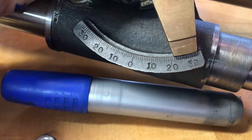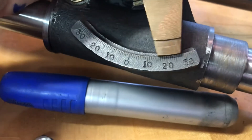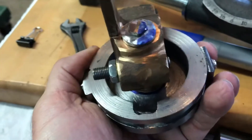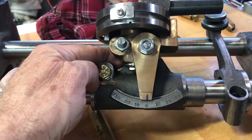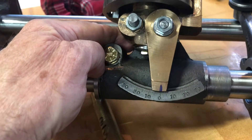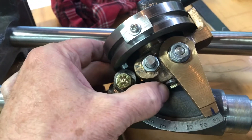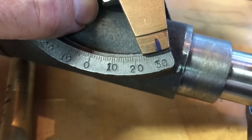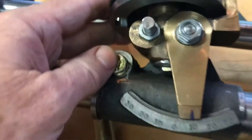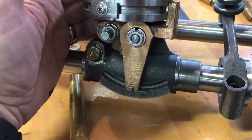The actual index mark is going to be about where the 30 is, if not beyond it, and that's all the original plans called for — 30 degrees of travel. That was a pretty easy fix. I've marked roughly with a big fat Sharpie where the zero mark is, and rotating it down the table is interfering at over 30 degrees — about 32 degrees of travel. I'm good with that and don't see needing any additional modifications. I've never ground anything that needed more than a 30-degree cut, so that part is solved.